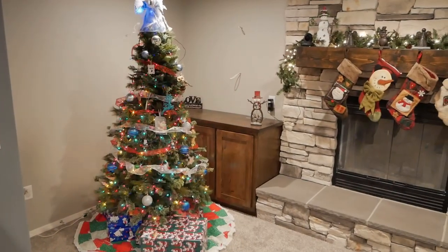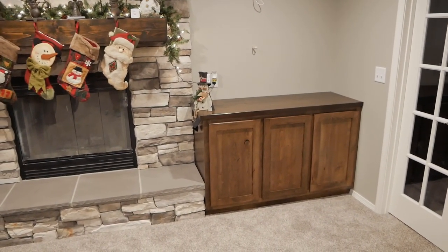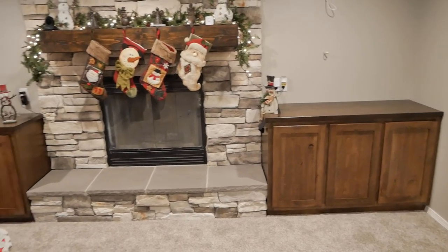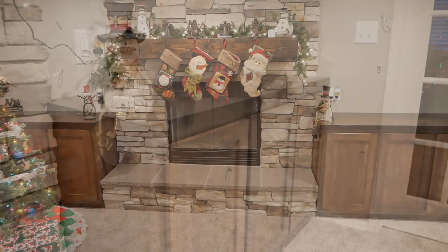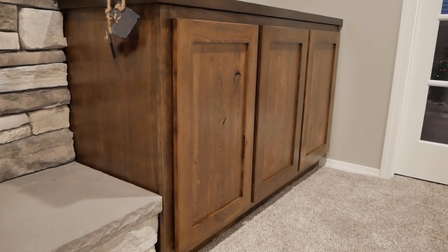Here is a final look at all the doors installed on the cabinets. Yes, this video is coming out in May and there are Christmas decorations — I've been sitting on this footage for several months, so enjoy the mid-year festivities. The finish came out extremely smooth on these doors. I didn't have to sand out any debris or air bubbles using the Minwax water-based polyacrylic and spray gun method. That is how I sprayed and mounted my cabinet doors — hopefully this helped you out. Hit that like and subscribe button, and check out the other videos in the basement build playlist. Thanks for watching, and I'll see you guys soon.